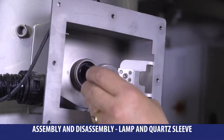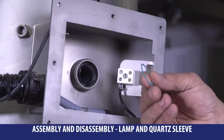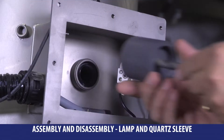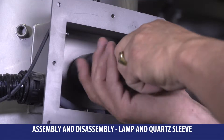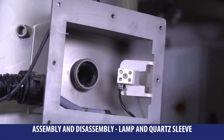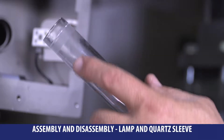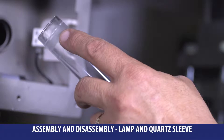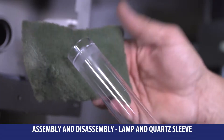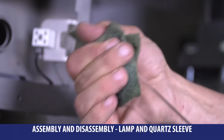Remove aluminium rings and wedges. Then screw on only one side the quartz remover and turn its handle to carefully take off the quartz with your hand. Control the quartz condition, cleaning the sealed face with an abrasive pad, and if necessary, clean the quartz surface with acid.